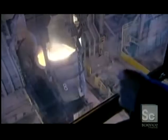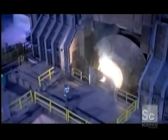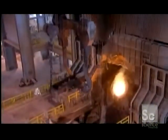After several hours, the molten mix goes into a refining furnace. Pipes blast in argon gas and oxygen, converting some impurities to gas and causing others to float to the surface for easy removal. A technician regularly checks the temperature and takes samples to make sure the chemistry is right. A bit more scrap is added to bulk up the mixture as it melts, and the scrap also causes a chemical reaction that helps to fuel the refiner.